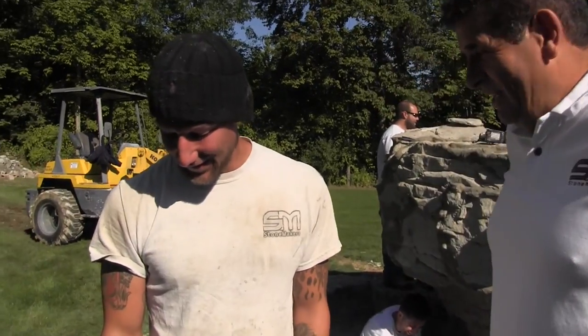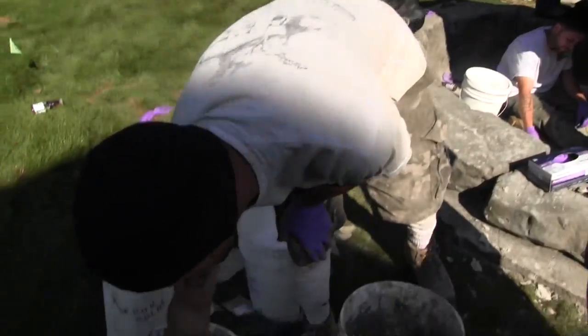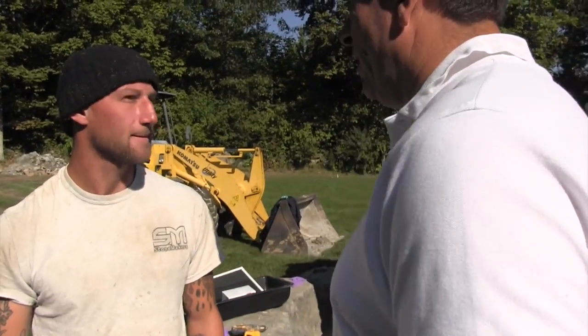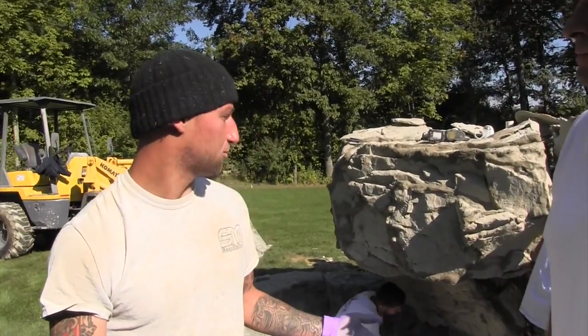Go ahead. So basically, we're not making whole bags at a time because just a few of us are patching, so we don't want it to set up on us, and we want to really detail it. All I do is add a full cup of water. That's a really good thing that you said, because a lot of times they make a full batch and then it sets up quick. This stuff is like 10, 15 minutes, and you can use the wall finish to soften it back up, but if you're going a little at a time, and what did he say? I'm trying to detail it. He's not just trying to mud it. He wants it to look so authentic. So it takes them a little bit longer, but like you said, you could mix a batch and throw it up, but if it's not going to look good, then there's no point in doing it.